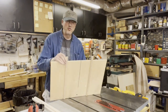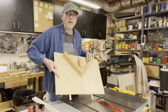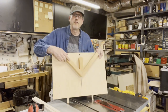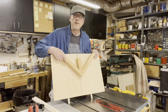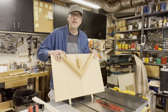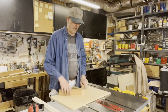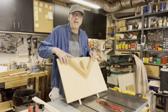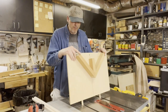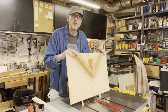The back has two runners that will fit right into your miter slides. The front side is made by securing a piece that's already been mounted with two boards that are 90 degrees to each other, and then mounted dead center on your sled. To make it, you would first put the runners on the piece of plywood, place it in here, start to make a cut, and then you'll know where the center is to line up these pieces using any 45 degree tools you have. Once it's in place and you do a little bit of adjustment as necessary, you can go ahead and screw it down tight.